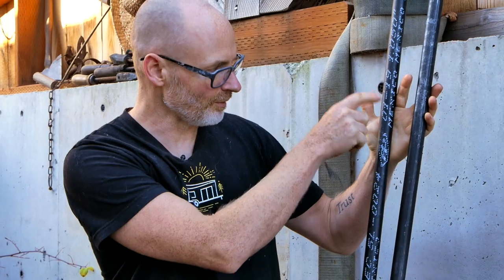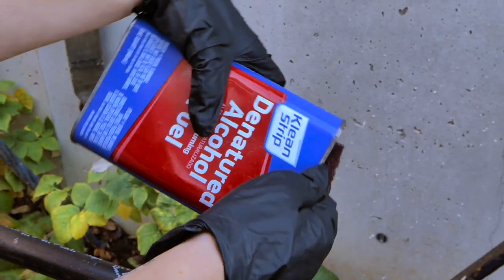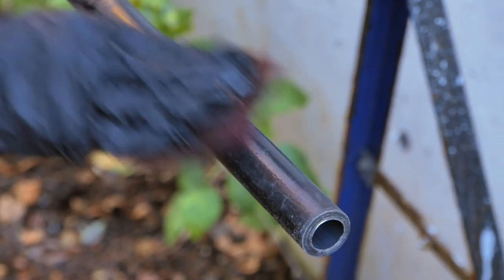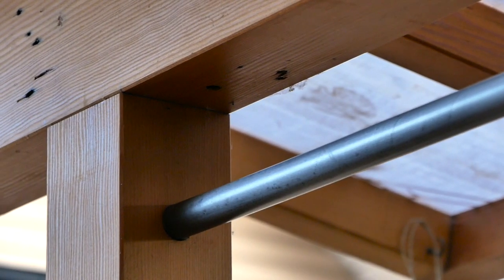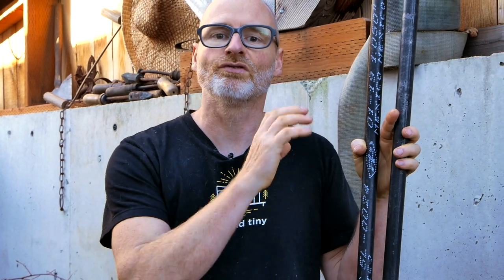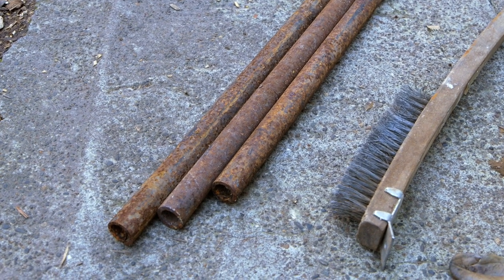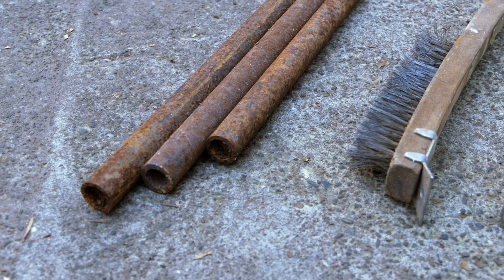Next we head outside to work on the steel pipe. First I'm going to clean up this pipe — black pipe has some lettering on it that I'll scrub with a Brillo pad and some alcohol to get it down to clean black pipe. Black pipe comes in lacquered and just oiled; you really want the oiled version. There are lots of ways to treat different kinds of pipe: scrub it to bare metal with stripper for a bare steel look you can wax, scrub galvanized pipe for a clean galvanized look, or use toilet bowl cleaner on galvanized and then gun blue to get a unique gray color. One of my personal favorites is to lightly scrub old rusty steel pipe with a wire brush and cover it with spray lacquer for a really nice earthy reddish-brown look.